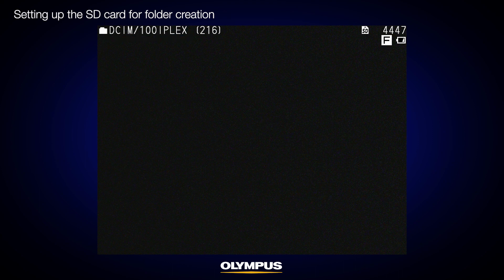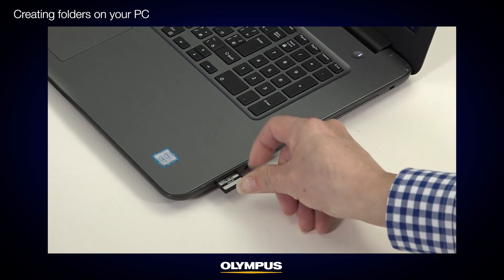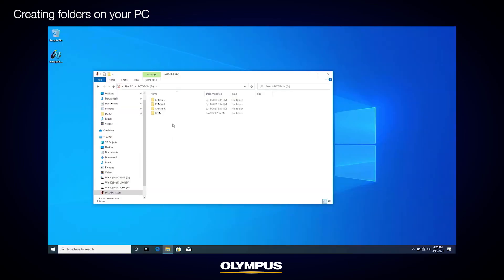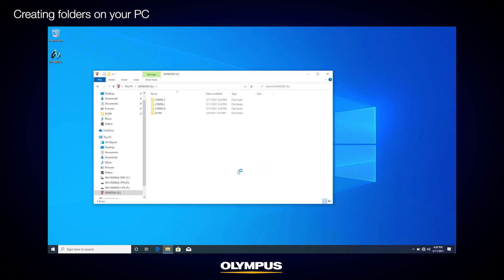However, you can make a copy of your own first and second layer folder structure on your PC. Simply insert the SD card into your PC, open Explorer, and add folders as you like. The folder structure must be in first and second layers, and you cannot use a space in folder names. If you make a standard folder structure on your PC or server, you can copy them when you need a new blank folder set and share them within your organization for standard inspection procedures.